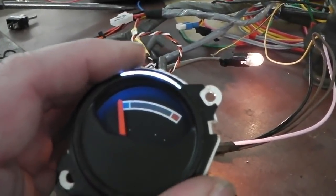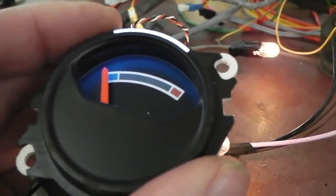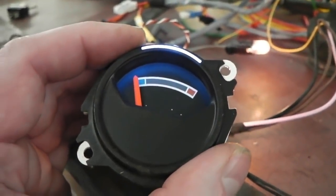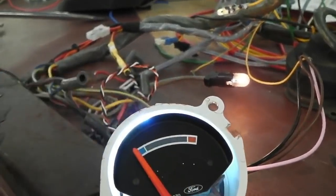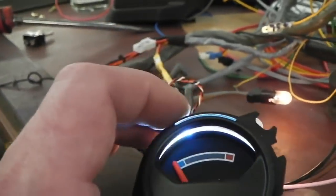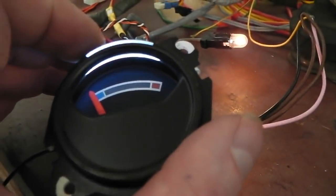So the great thing about these gauges is that they do that very nicely, and you can already see in broad daylight how you get a lovely crescent illumination there. It's going to be beautiful at night, much better than incandescent. And I recommend sticking to as close to white as you can get. Don't buy a blue bulb for these. Let the paint do the work for you, and you'll see, look how lovely and colourful it is in there.